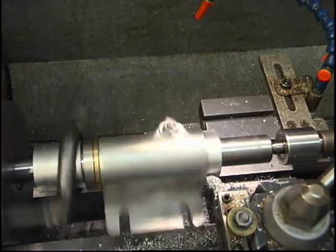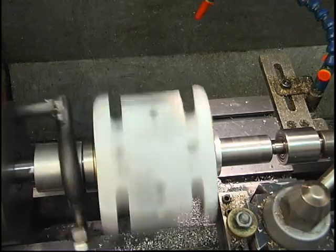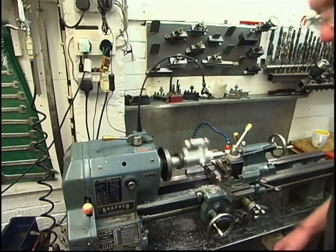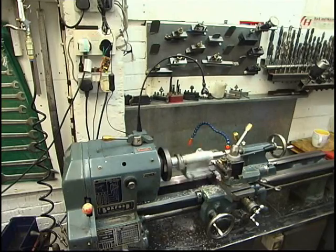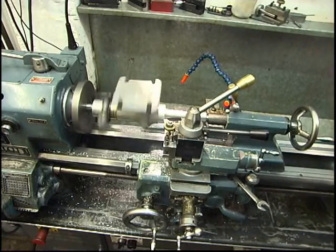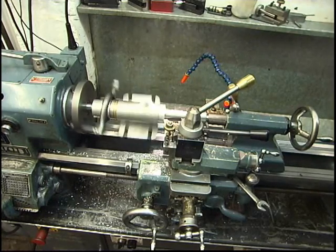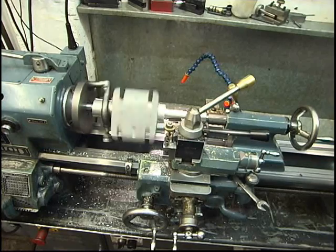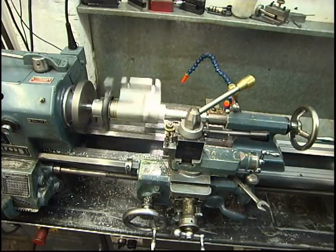Turn it on, face and roll. Just speed it up — it's all going to be around 90. Just going to whisk by this end, it's cutting absolutely perfect, dead flat — it's got to be because that was fly cut at the same time we machined the bore. I do want to turn it around — there's a little bit on the other end that wants machining off, just a bit we couldn't quite get with the fly cutters. I want to do it this way, making the next job of it.